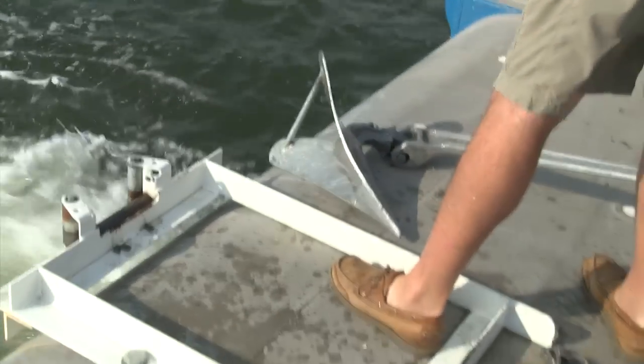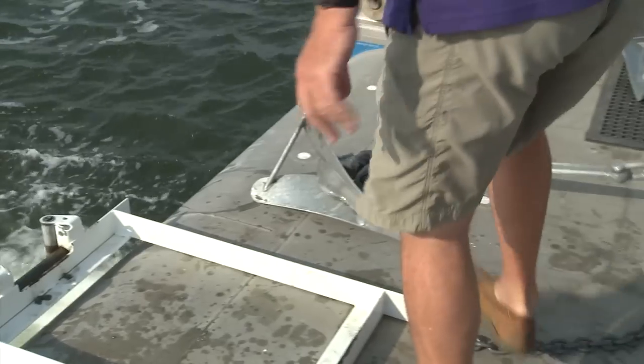If you're buying or selecting an anchor, what do you make of these tests? The thing we can't figure out is how an anchor could go from holding roughly 500 pounds of tension to almost zero tension and back up to 500 pounds in such a short distance. Our opinion has been that anchors start on the surface in soupy mud, slowly engage, and the mud gets firmer as they go deeper. But if an anchor goes from high to low to high in as little as 40 seconds — 6 or 7 feet of distance — we really don't have an answer for that.